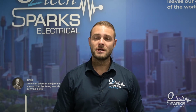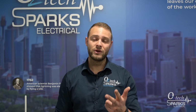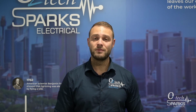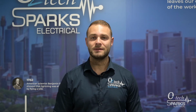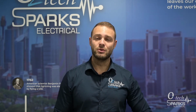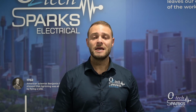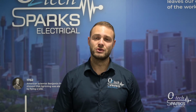Just a useful hint, guys, each phase that comes through your property, whether you have single phase or three phase, needs its own surge protector. So let's say you have three phases to your property, there has to be a surge protector for each phase that comes in. In summary, surge protection in your switchboard is the best form of defense for your electronics and appliances around your house if any form of lightning, thunder strikes, weather, or electrical surges happen.